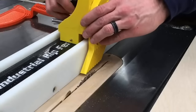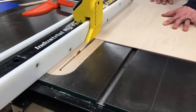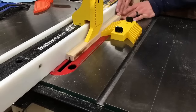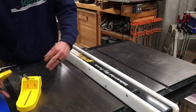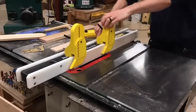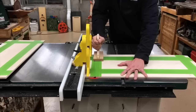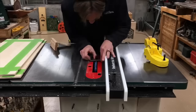Next, the Vertical Featherboard Pro mounts to the center of a Biesemeyer style fence in order to provide downward force when thin workpieces tend to lift up or when very consistent depth for non-through cuts is necessary. The featherboard section is reversible, so it can work on either side of the fence, and two of these can be used together with a piece of sacrificial material for identical rabbet cuts. All of this functionality also makes this the perfect companion for the Rockler Miterfold Dado set, where precise cut depth and cuts on each side of the fence are necessary.